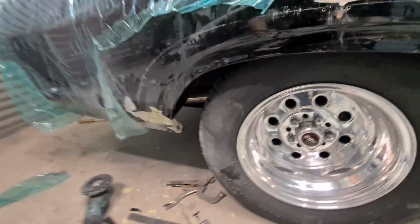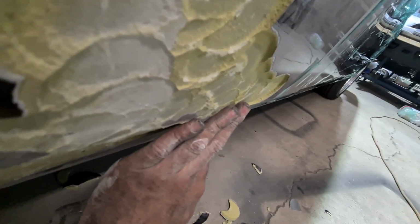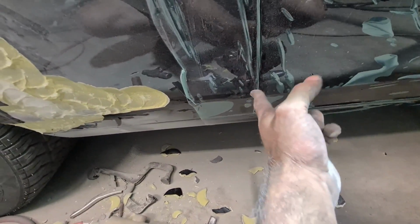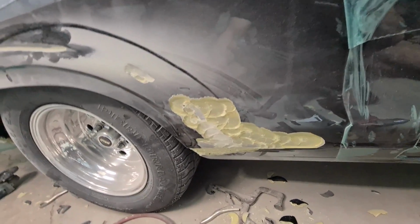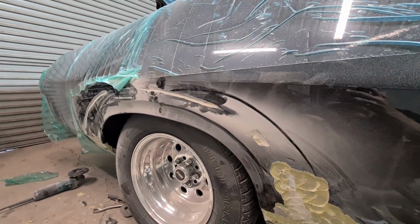Raw the rest of it. Some bare metal here, which is nice. So yeah, it just gets worse and worse the further I dig, and the problem is I have to dig somewhere where I can actually join nicely, and I'm assuming that they've just added 10 mil of thickness to the whole car. Probably explains why the door shuts nice and it's in, so I wouldn't be surprised if I go all the way up to the edge and this whole edge is bogged as well, which is depressing, because it would have been really nice just to be able to do a little section here and they can just bog it to suit and paint it. I really want to avoid going near the body lines and stuff, because everything else on the car is shaped to suit, so it's just a double-edged sword here.